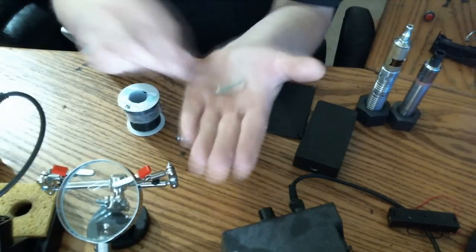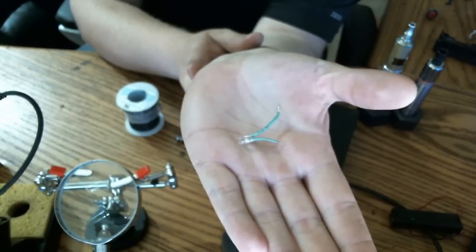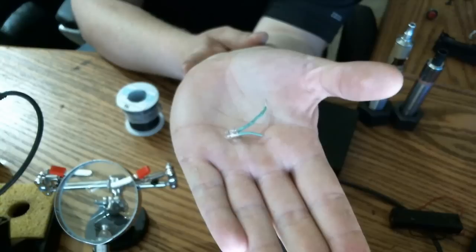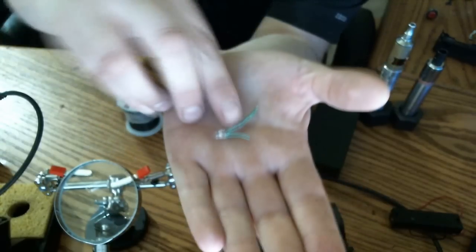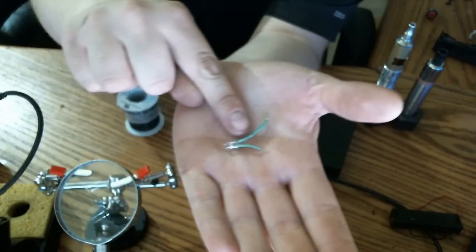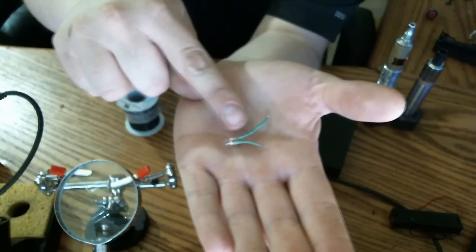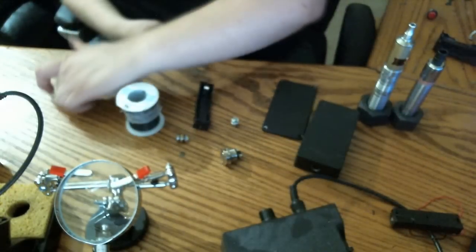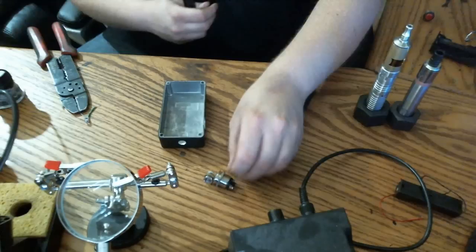And like I said, optionally, I'll be installing an LED. This is a 5mm high bright white LED, 3.3 to 3.5 operating volts at 25 milliamps. Inside the heat shrink here, I've already wired the resistor. Basically, all I did is cut down the resistor so it had shorter tabs and solder it onto the LED and then heat shrink both leads. So just a quick little fix. Moving on to the next step now, we're going to start fabricating.